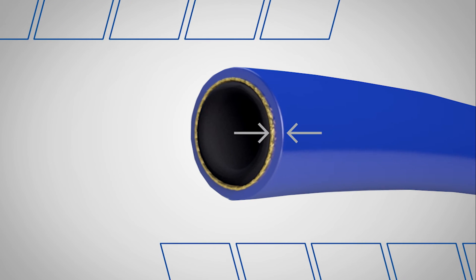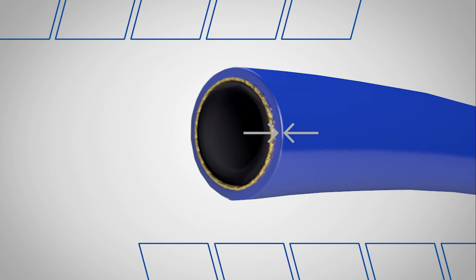The biggest drawback of virgin PTFE is the translucent appearance. Acid is used to etch the outside of the tube. This helps the rubber cover bond with the PTFE, but it also leaves discoloration on the outside of the tube. This can be perceived as dirty. To resolve this issue, a thin layer of pigmented, white PTFE is co-extruded with the virgin PTFE.